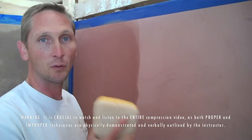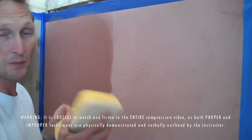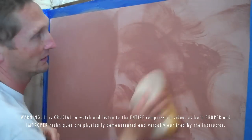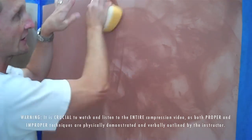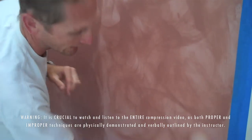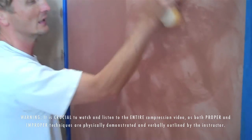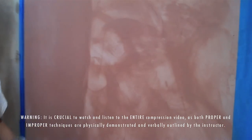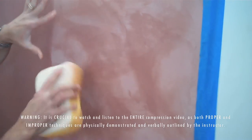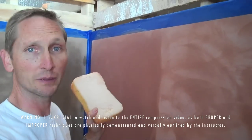The other issue is when people don't get enough moisture onto the surface — the sponge compressing stays very dry and you don't get a nice even coverage. You're doing it a little too quickly and you'll end up leaving streaks. Some areas aren't even touched, other areas were worked, and everything isn't done completely, leaving variations in color across the surface.